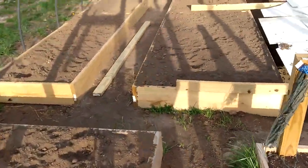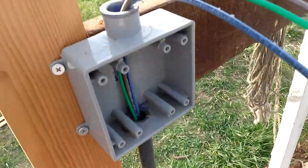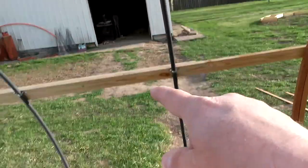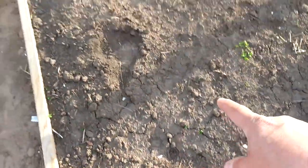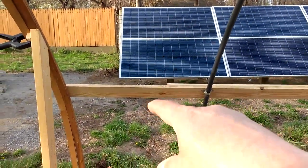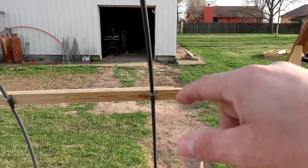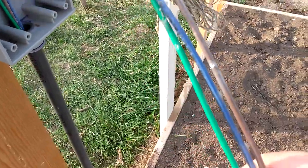A couple more ideas about building your greenhouse: electric. It's 10-gauge wire with three conductors for 240 volts. Half-inch conduit curves underneath this bed, very deep, going into the barn. Three-quarter-inch PVC water line goes way under the ground, curves around, and goes there too. We trenched in power from the solar cells right underneath the garden at the same time. We'll bring water from the barn and tap into electrical here — this will give us lights and enough conductor gauge for up to 5,000 watts of heat, so we can hang an electric heater.